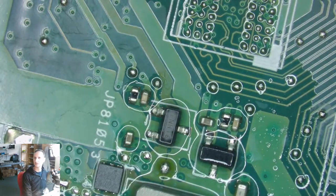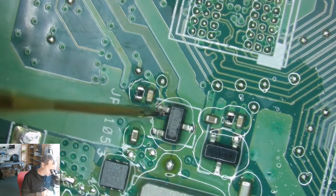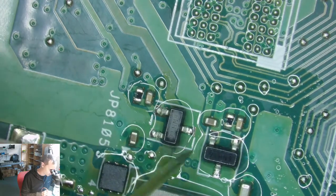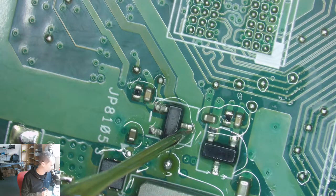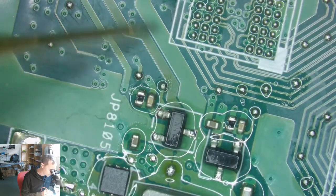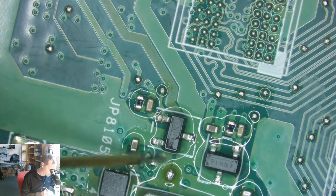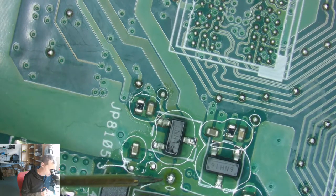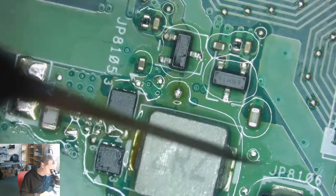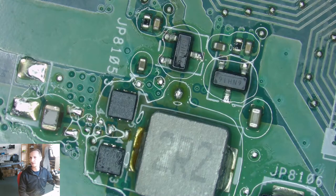Okay, let's make some measurements. Diode mode. Probe on ground. Open. Good. This is the lane which is nearly 0.001. This goes underneath here, then here, going here to this thing. I don't know if we should isolate it. We have these jumpers here in the middle.